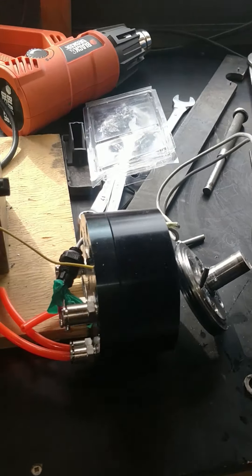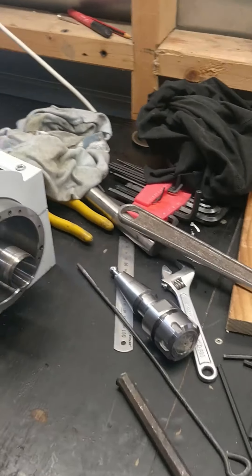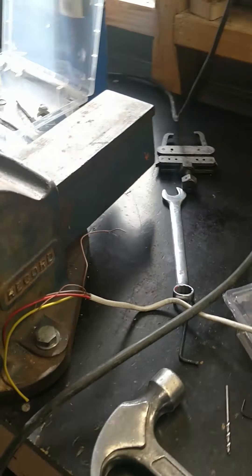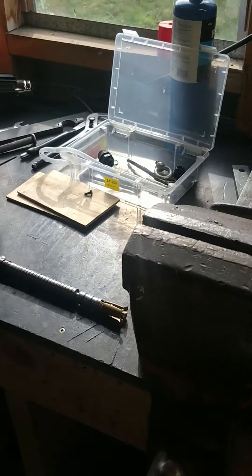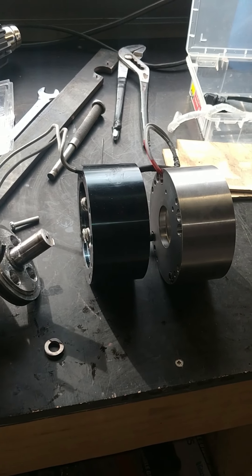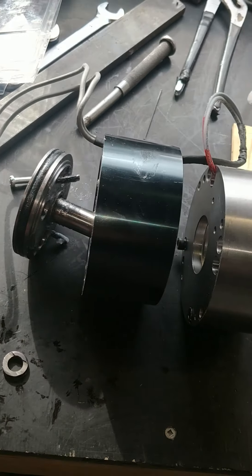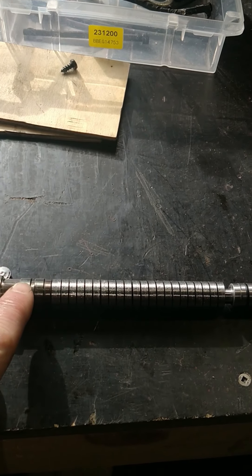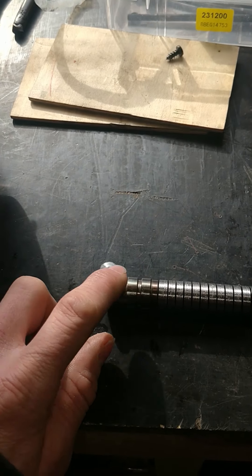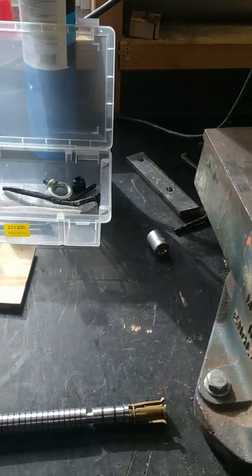I hope that helps anyone who encounters the same issue. I couldn't find any information on the internet about this spindle, so I was hypothesizing against schematics of more popular spindles to figure out where the issue could be, how to get into it, and how to find the spare part. I think I'm going to have to get a whole new releasing piston assembly and push rod end. This end actually unscrews from the push rod — it's a separate piece — and there's an O-ring here that guides it through some grease in the end of the spindle. I think I'm going to be okay.